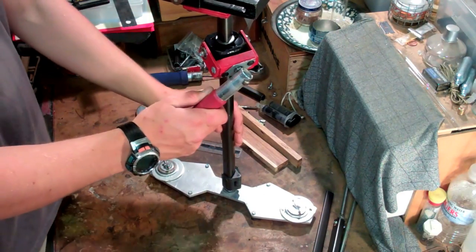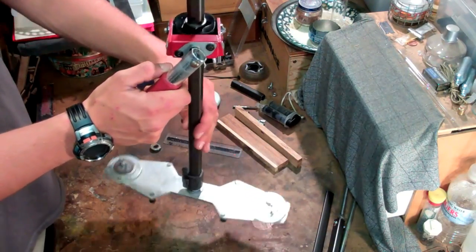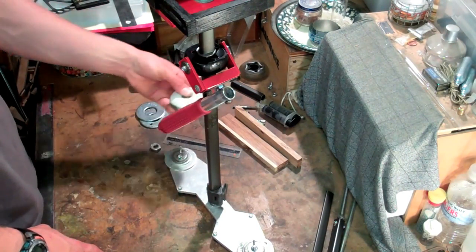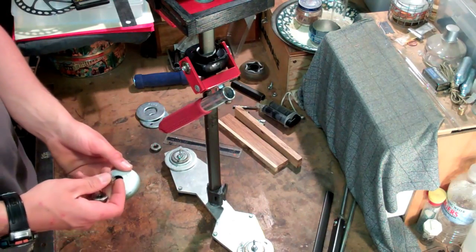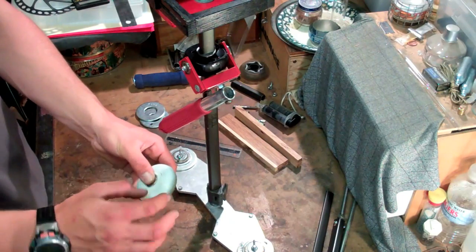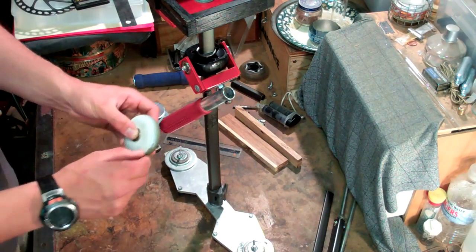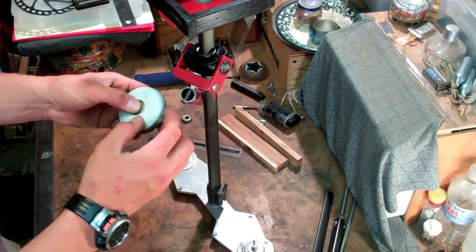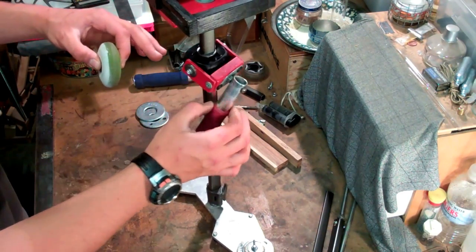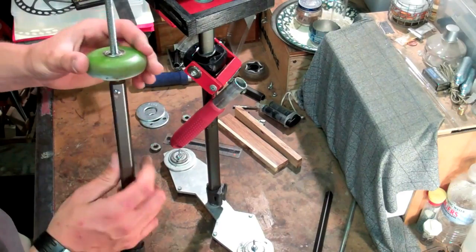The next piece going up is the gimbal — probably the hardest part to make. It needs to be very smooth and precise. I used a roller blade wheel rather than a scooter wheel, because they're smaller and more precise. I cut off the sides to make it a little more square and smaller, since you don't want a big bulky wheel in the middle. Just cut off the corners, sand it down a bit, and that gives you the center piece that spins around, which goes right on top of the shaft.